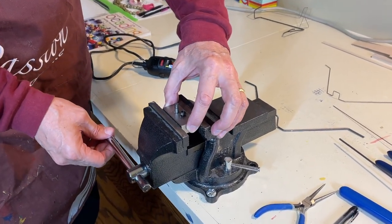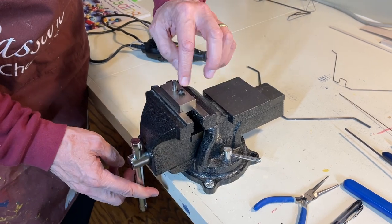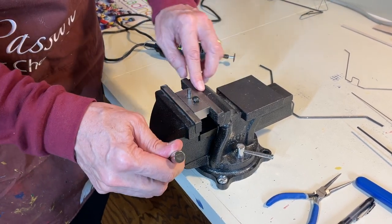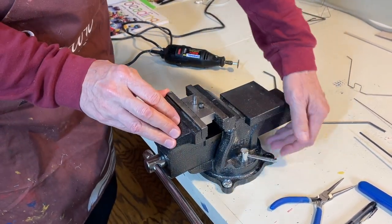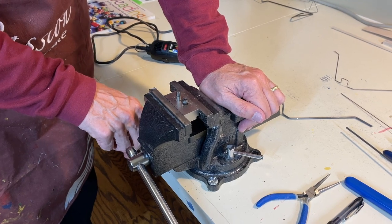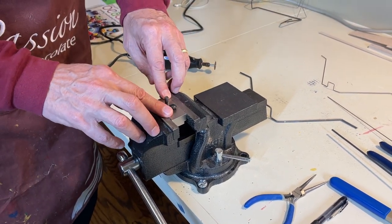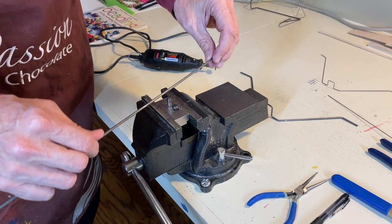So let's take a moment and set up the bender in the vise. Here is the wire bender right here. There is a ledge under here — there's the option of doing it like that. However, I prefer to put it between the vise jaws here; I have a little more of a flat surface to work on. This is very, very hard metal, and a vise is absolutely required — there is no way to hold it by hand. Because the vise takes up bench space, I have two removable bolts so I can remove the vise when I'm not doing metal bending tasks.